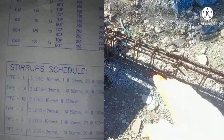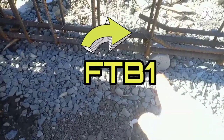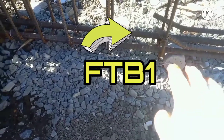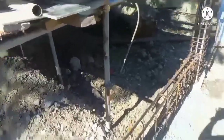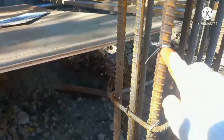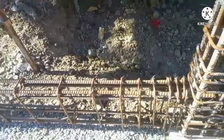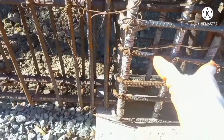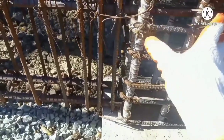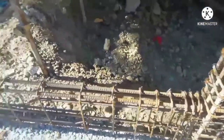For the actual construction, we need to first secure the area so the soil below doesn't hang loose. There must be gravel bedding below and spacers so the rebar doesn't rust immediately. We won't have difficulty with the formwork since the posts are already level. There are markers around — the measurement going down is 150mm. Before forming, make sure the area is clean. Before we pour, we clean it well. The top of the post pour was covered — as advised by our engineer and architect vloggers — there should be no cement residue so our concrete bonds properly.